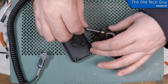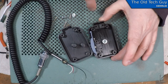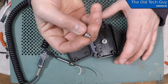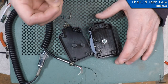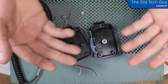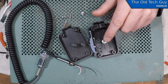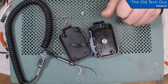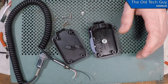These holes are 3mm and that is just perfect for a 6-32 screw thread to bite into — the kind of screws you'd use to mount a hard drive will hold things in. I'm going to put this together but not wire it up yet because I don't know the wiring for the uBITX. I've got to find documentation for the kit — it doesn't come with even a link to documentation, but I'm sure there's documentation I can find online.